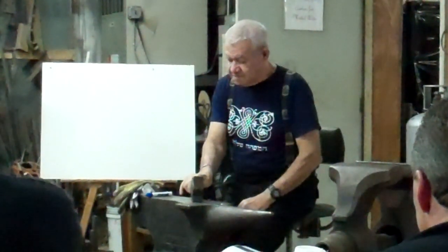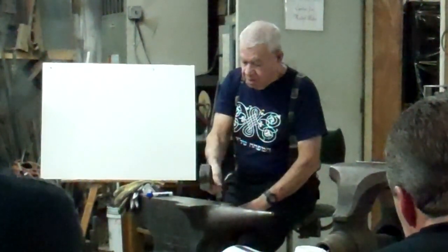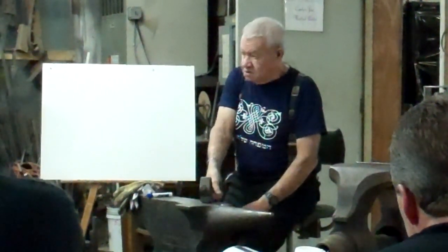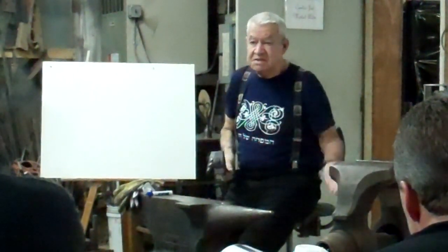The other thing is, if you hold the hammer tight and you go down and you press with your power, you stop the hammer. Now, going down with the hammer is not a problem. God arranged the world this way that everything is falling down. And we have g and we have acceleration. We only add to it. The problem is when we are down here, we have to raise the hammer. This is the place we lose the power. Not going down, going up.